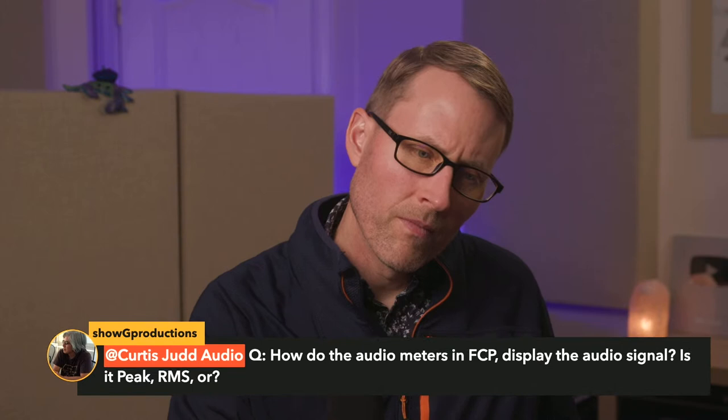Going back to Moon Moon's question. So you're asking about time code. I don't know that I recommend it, but what you can do is feed the timecode output of the Zoom F6 into your camera, and you can record that timecode into your camera. That'll feed through to the Atomos recorder, and at the same time you're recording the audio on your Zoom F6. Then in post, you would have to convert the audio in the video clip to timecode. So you're going to have to have a software tool to do that.